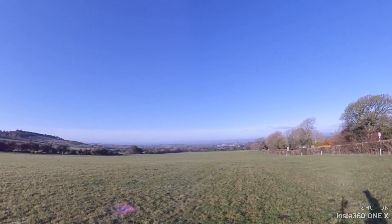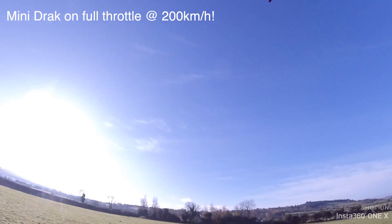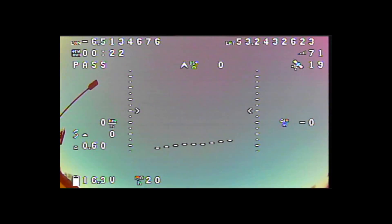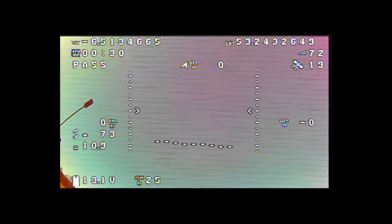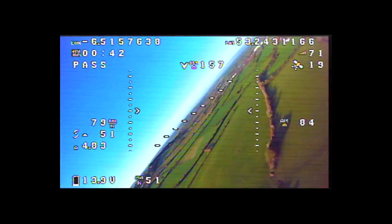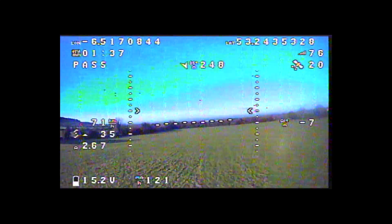Second lipo, flight three with the Viper. The next two passes are the Viper and the MiniDrac — I did this to compare the sound difference. I've made some changes to my OSD layout: I've moved some figures around so they're not overlapping, added milliamps at the bottom, and put my amp draw next to my throttle percentage. My GPS coordinates are now at the top of the screen so they're recorded on the DVR. On launch I'm using around 73% throttle again and pulling around 10 amps. I am launching this plane in manual mode and will continue to do so every time. From this footage it's able to fly nice and low and stable now the trimming is sorted.